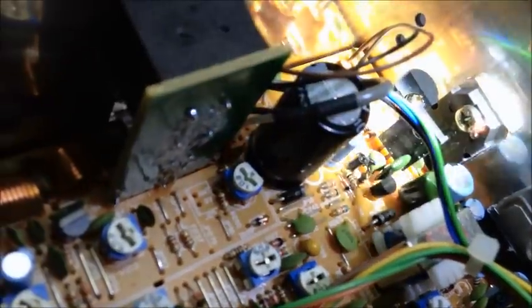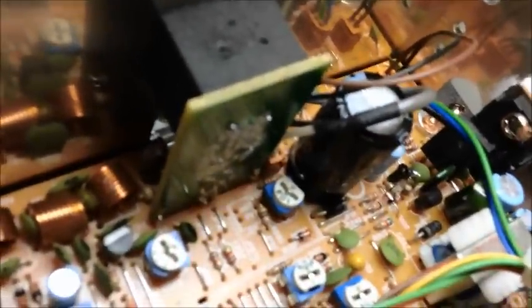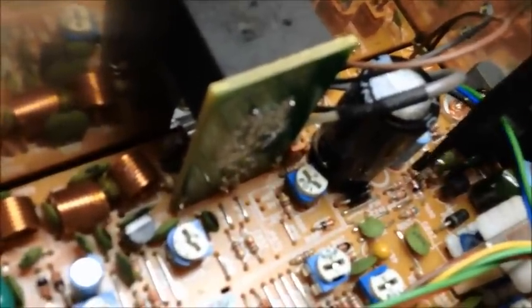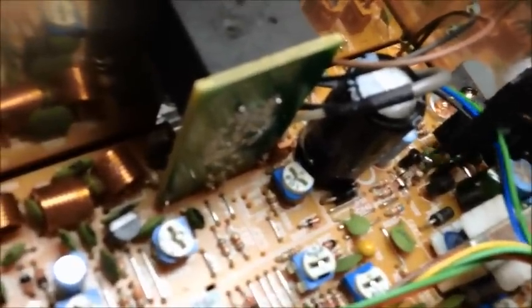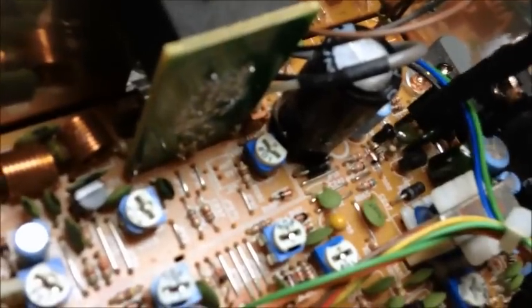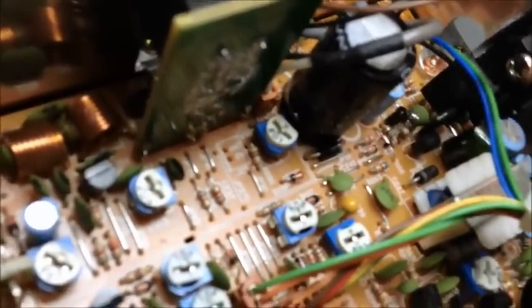That's what I call them. It's supposedly a form of an MPC mod. I don't know how well you can see. Let me flash a little light down there. As you see, there's a little rectifying diode attached to a resistor down there. For one, a rectifying diode is not really the right thing to be used in these radios. I'm not trying to tell technicians how to do their stuff, but that's the wrong thing to do right there. And I see this all the time, radios coming in here, and that's why you've seen that Bird meter get real lazy after it got over 10 watts.